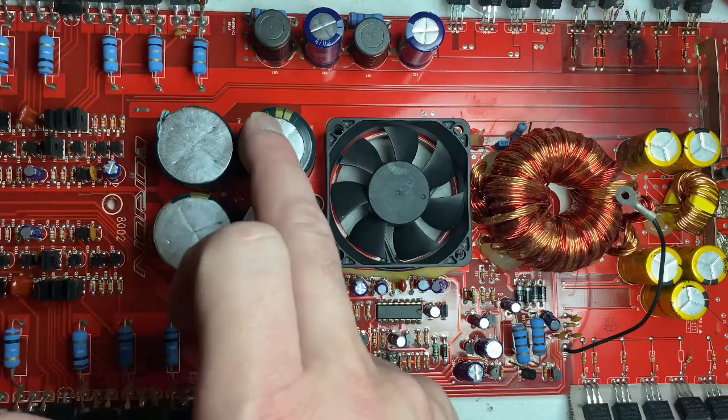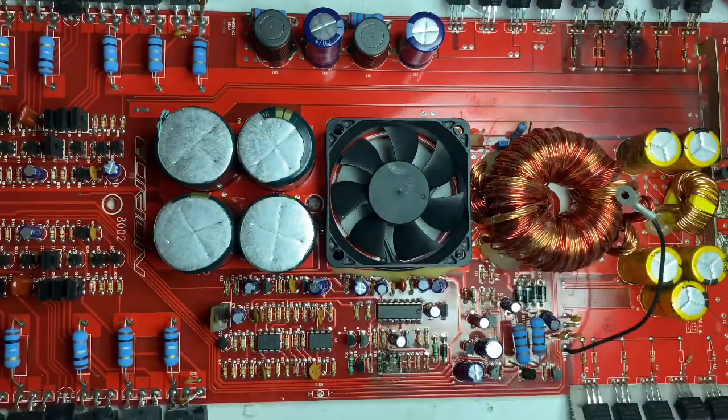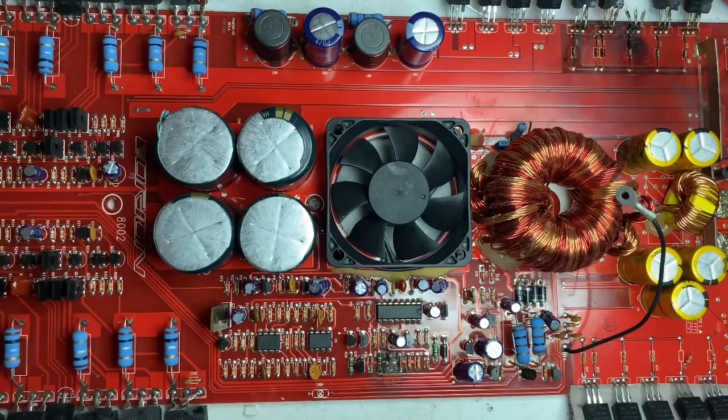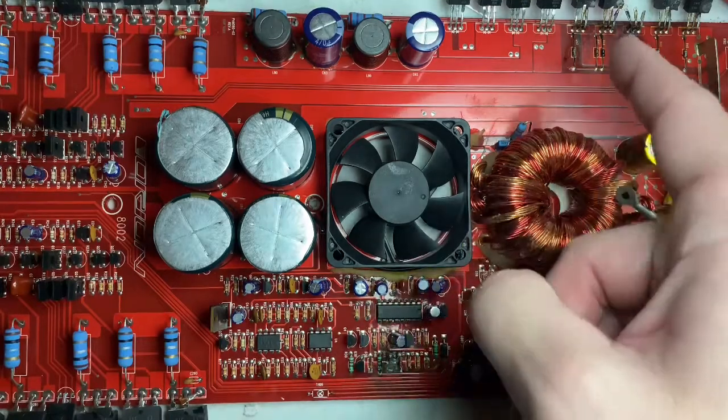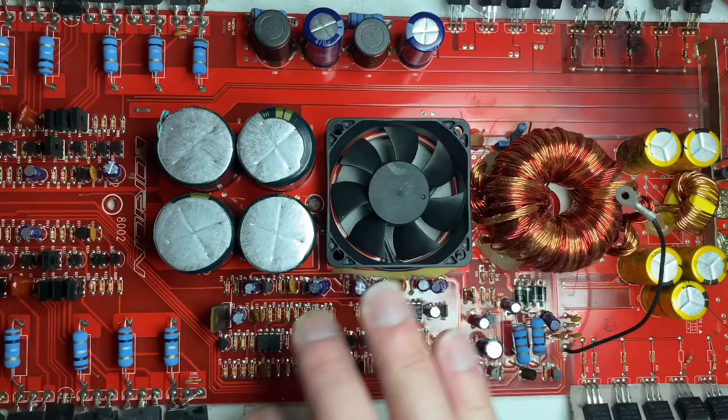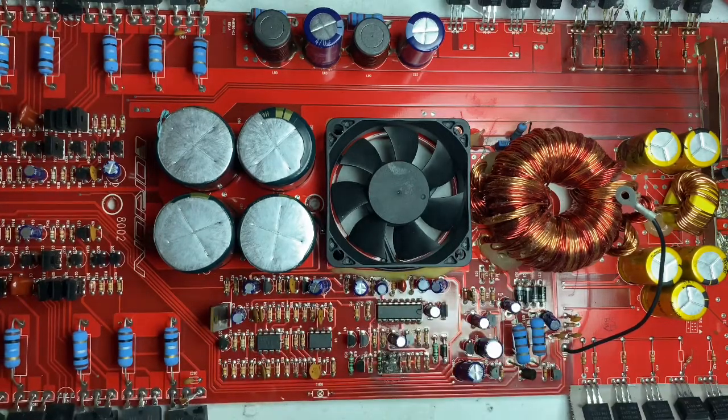Capacitors and other components emit an odor. With these going bad, the electrolytic fluid smells like fish — they have a very fishy, organic smell. You would notice these other components here do smell when they burn. This circuit board is fiber, basically a fiber board. It just smells like carbon — that's all it is, a carbon buildup — and it just smells like a burnt board.